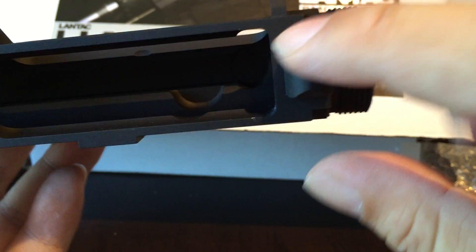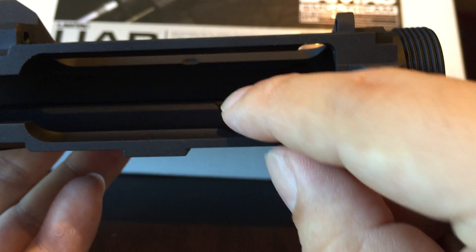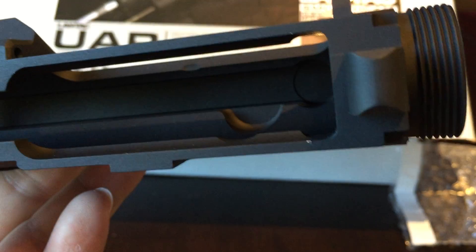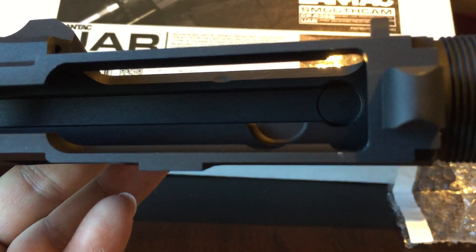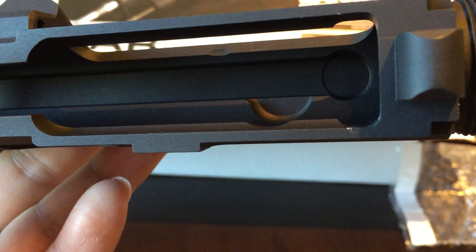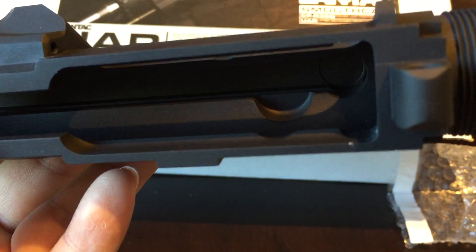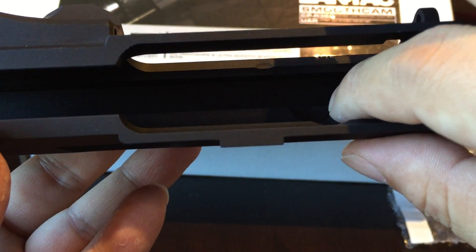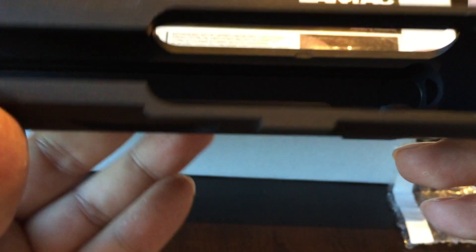In the recess for your bolt cam pin, they've machined off the edges — little rounded edges on each side. Usually those are sharp. What that's for is so the cam pin doesn't nick the edge; it has a little more forgiveness. I haven't ever noticed my cam pin hitting them, but anytime there's a sharp 90-degree edge, that's always the weakest point of metal. So this gets rid of some of those weak points.